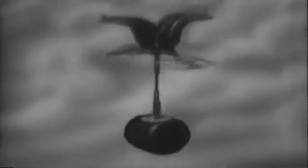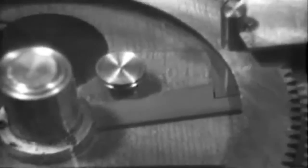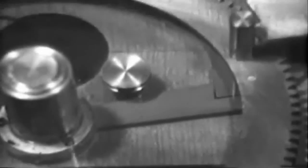The anti-disturbance fuse operates in three stages. When the spindle is withdrawn a quarter of an inch, the timing gear turns until the stud on the bottom of the timing gear engages the impact spring. On impact, the spring frees the timing gear, allowing it to continue turning until the stud on top of the gear is stopped by the anti-disturbance block. The slightest jar will disengage the block from the timing gear, allowing the gear to continue its run until the striker is freed.